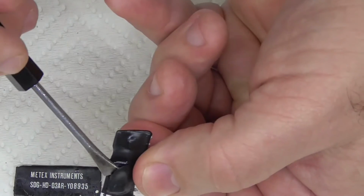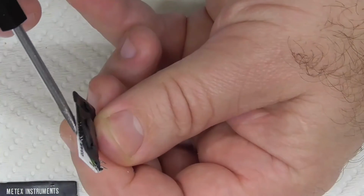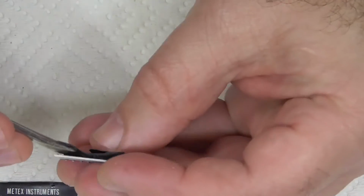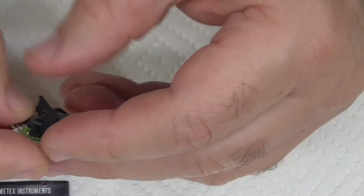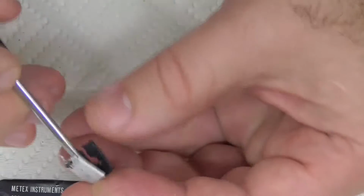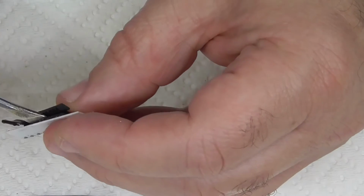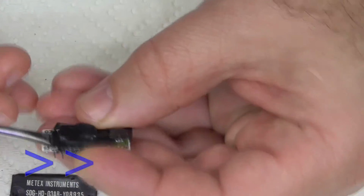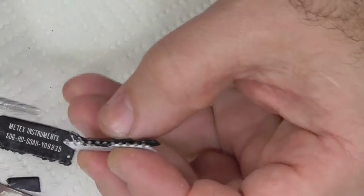Okay, so it's burst on the top of that chip. Alright, so I could do with a bit more soaking, but you can definitely see an IC. Putting a little bit of pressure on there. The main thing is I don't want to rip any components off. And if I can, as much as possible, I'm going to try and get it off in one piece. That way it's easy to see if I've ripped any components off. Hopefully that big chip isn't a microcontroller or anything like that.